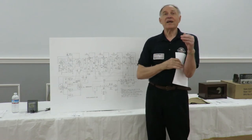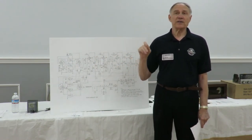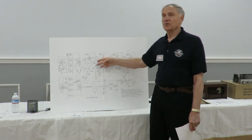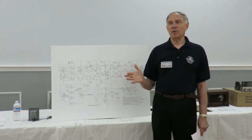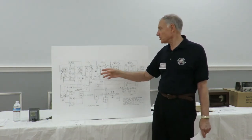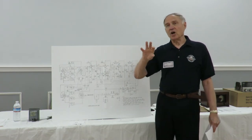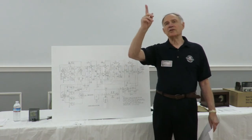What I also do is measure the inductor. If you measure the inductor, and you know what the output frequency should be, 455, you can figure out what the capacitance is. I believe it's 120 pF. And you get the nice small ones that fit right in there, put them back in, test it before you put the thing back in, put a signal on the input of the transformer, measure the signal on the output. If you have an analog generator, you can sweep past it, you can watch the thing come up.